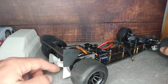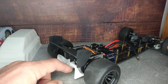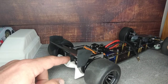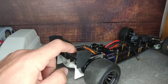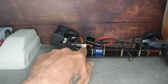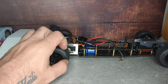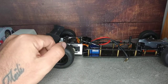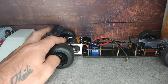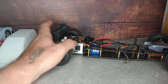I've cut the upper deck. I like super short wings, but honestly that doesn't really make much of a difference. I think all the downforce at the rear is coming from the diffuser, because when I'm running the tiny wing or this one which is slightly bigger, I have pretty much the same downforce. The SDR aluminium pod is fairly heavy already, so you have quite good traction at the back, which is what I find with the pan car — the less the body interacts with the air, the better the handling.